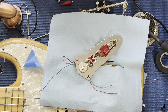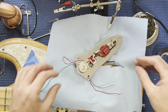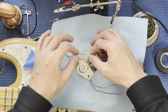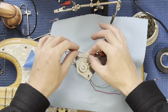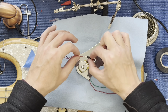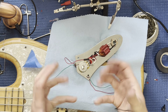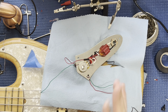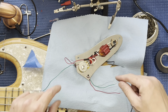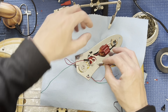If you have helping hands use them, but I'm trying to show this for those that don't. There it is - it doesn't take much, you're just holding it while the solder connects them. When you're all done, you'll use radiant heat from a lighter or a heat gun to shrink the tubing - a hair dryer might even work but don't quote me on that. Then same thing with the other connection.